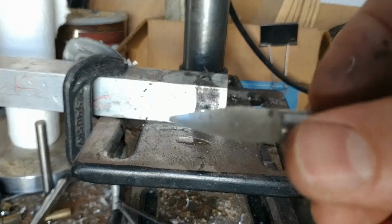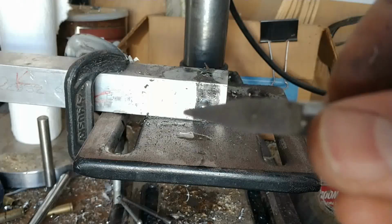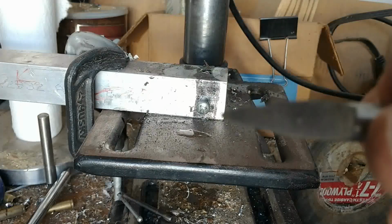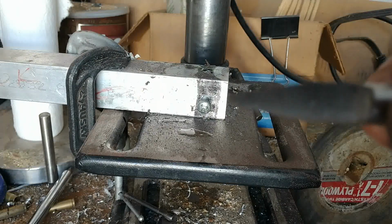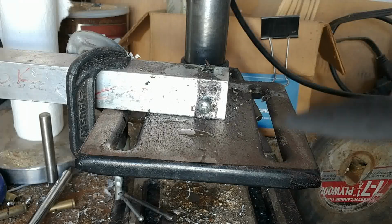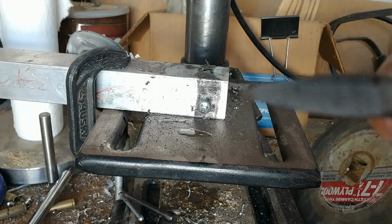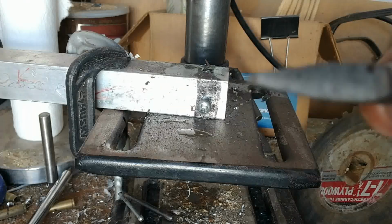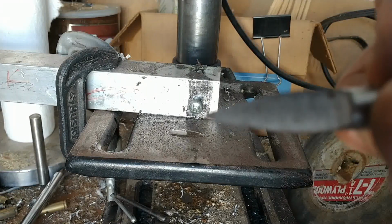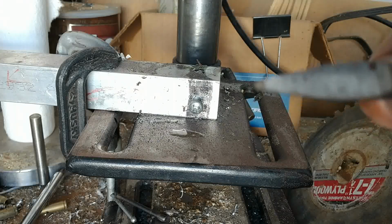Now, like I said, the tip here is a little bit pointier than I'm actually going to want it. That kind of mimics what the plastic tip would be on like a Hornady VMAX 110 or a Nosler, what do they call the Nosler black tips? Those bullets. So what I want to do is basically imagine that I yanked off that plastic tip and leave my cutter the shape that's more or less left, and that will be something that will cast better and be less likely to damage on feeding, and also have essentially the same weight distribution as the commercial bullets.